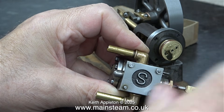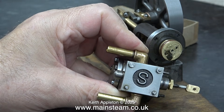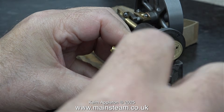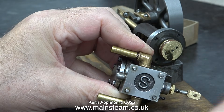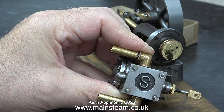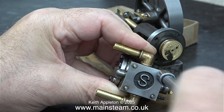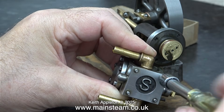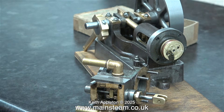And here, once again, I'm removing the 7BA nuts that hold the steam chest cover in place. I will need to make some new gaskets for this, because the gaskets that I showed myself making in the previous episode didn't quite work out as I planned. When I trimmed the external parts of the gasket with the Stanley knife, it seemed to get a lot smaller. It's easy enough to make a couple more — I won't bother showing this because I have shown it previously.